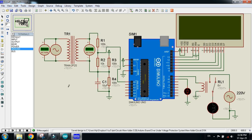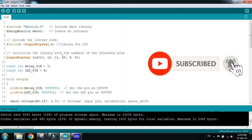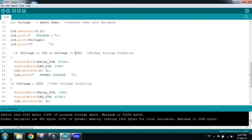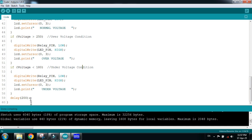The circuit is almost ready. This circuit measures the AC voltage, this is the main power supply, this is the main load, and this is the relay — it will trip the load when required. Now let me check the code. You can see comments are written for almost every line. The normal voltage range is 180V to 250V; voltage above 250V is over-voltage and voltage below 180V is under-voltage. Let me copy the hex file.